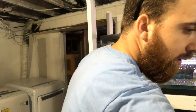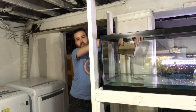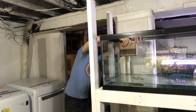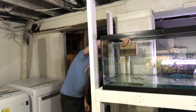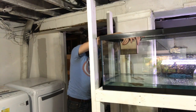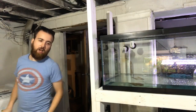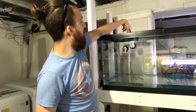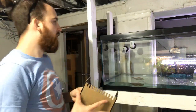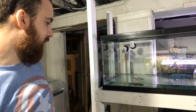So now here's my question to you guys, since I got some people in here that know a bit more about plumbing than I do. If I take the weir and put the weir on here, people were saying I need to leave an inch gap from the bottom of it to here. So let's say I leave the inch gap, and the water is allowed to flow up. It's still gonna reach the top of the emergency. So I don't know if I should just leave it where it's at, and then if it ever does clog, which I doubt it's gonna clog, but in case it does, the emergency pipe is gonna be higher than the teeth of the weir. So basically, it's gonna take until this thing overflows, and then the emergency standpipe should suck everything down.